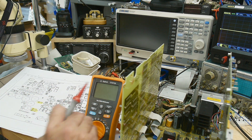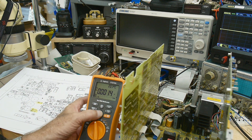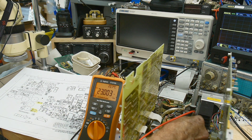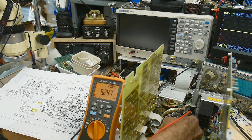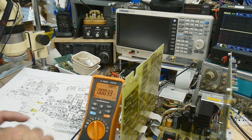Let's turn on the meter and turn on the machine. This one is plus 23 — very good. This one is plus 15 — very good. This one is plus 5 — very good. This one is minus 5.25 — very good. This one is minus 15 — very good. This one is minus 23 — not a good connection — minus 23. So all our supplies are good.